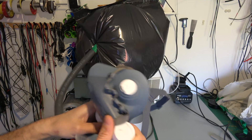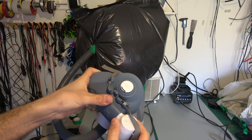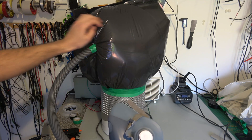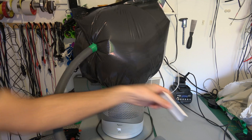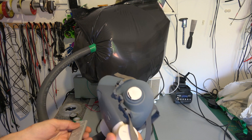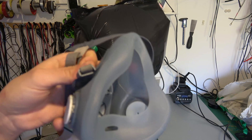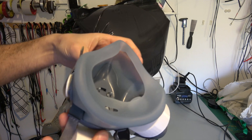So I'm just going to turn this on and give it a test. This is kind of in prototype stage — it needs bonding in there. If we turn this on, we'll see the bag inflate. There it is — it's now blowing. We can turn the fan up. I found eight is about right. If we go up to nine or ten, we're actually blowing too much air. And now coming into the mask is our high pressure air. You can hear that flowing out from there.